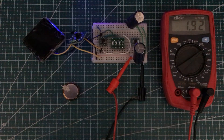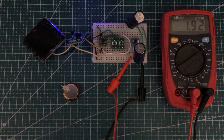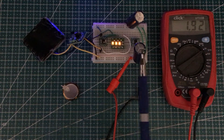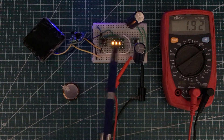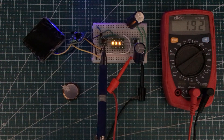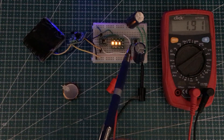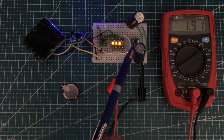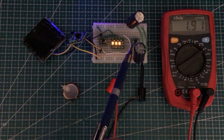Then I put two supercapacitors in there, both 30 Farad, and was getting probably around the two hour mark, which isn't so bad. In the original video, I started talking about maybe winding back the processing speed of the PFS154s. This PFS154, the original one, is operating at around about 500 kilohertz — galloping along really for the job that it's supposed to do.